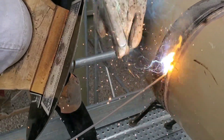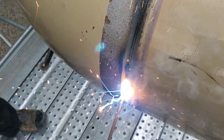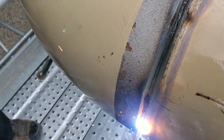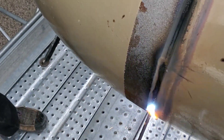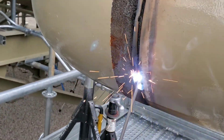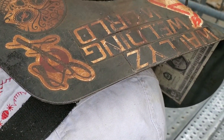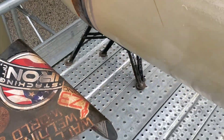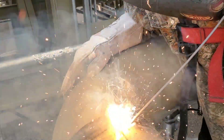Here I go with my second rod. I love beading — I'm always holding it with my hand so I can make sure I'm not arcing out all over the pipe. If you arc over that pipe and you get a cutout you're gonna have a lot of people upset at you, and you're also wasting time. Just want to get it down and stack some dimes. This is probably one of my favorite processes — a downhill bead. I've been doing it for quite a while and I love it. Sometimes it's getting tight down there and if I don't got the heat I ain't penetrating, so I got to go up in the heat.